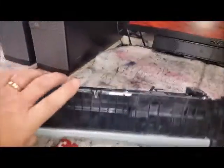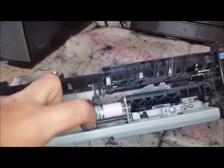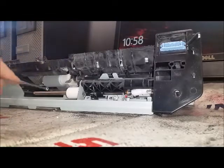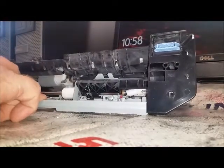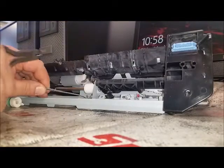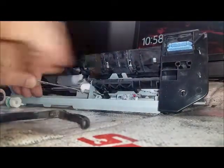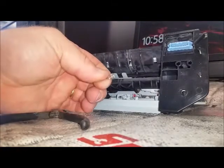What you want to do is flip this over and first take this cover off so you can gain access. You can see the spring right down here in this area — that's the spring we're talking about. Pull off these rollers and this torque limiter and you can get to the spring pretty easily. I've already shortened this one, but this spring is kind of hard to get off and back on the back side, so I just pull it out like this, take your dikes and snip off about three turns of that spring. You can see right there — that's how much I snipped off, just about three turns.